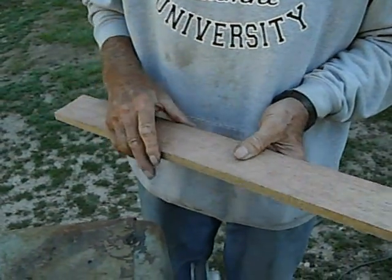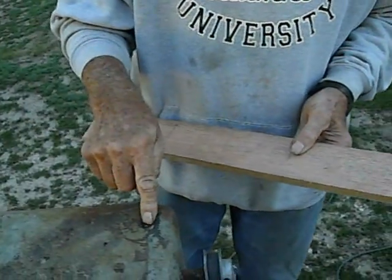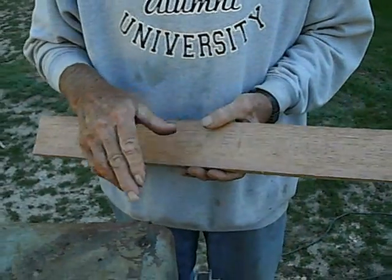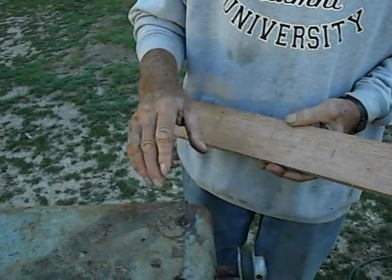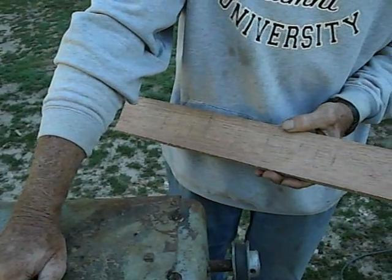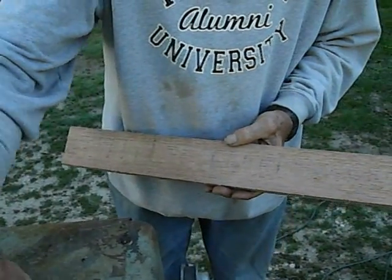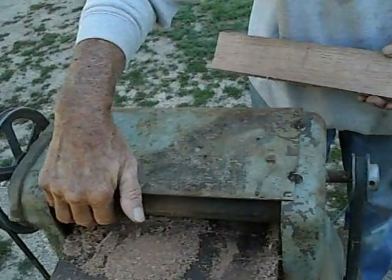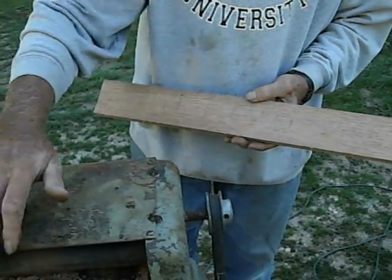It's obvious from the demo here that the feed system needs work. The springs underneath these 4 set screws here probably are not adequate. We've got them bottomed out. We're not getting enough pressure. Also, the outfeed roller is rubber coated. It could be that the outfeed roller is undersized now because of wear over time, and may need to be built up again.